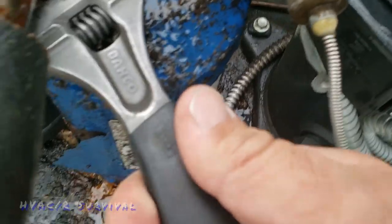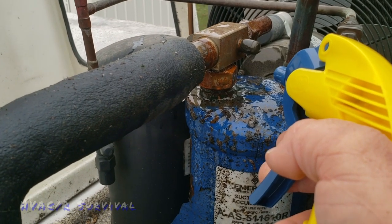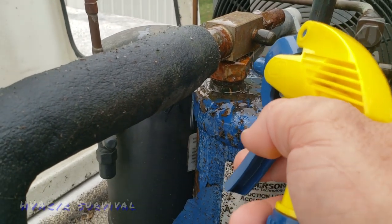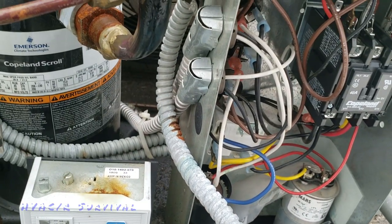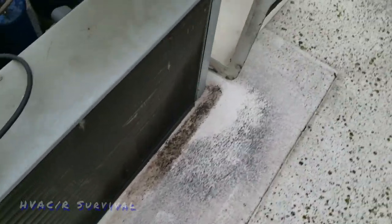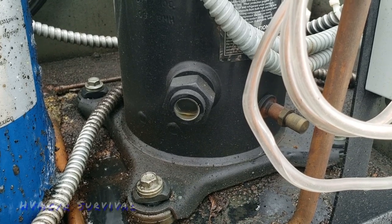Trying to get all the bubbles out of there so you can see if there's anything new coming in or if it's just what was created by pumping. We did scan around some of the other components to make sure they were not leaking. Let this clear out and then we'll re-scan it. You can see the fans have picked it up and blown it around everywhere - you got oil markings in the coil, the oil level's getting a little bit low on the compressor, may have to add a little bit.